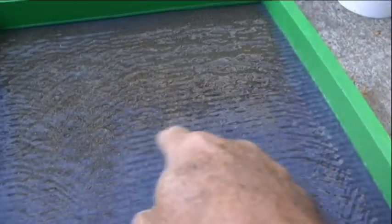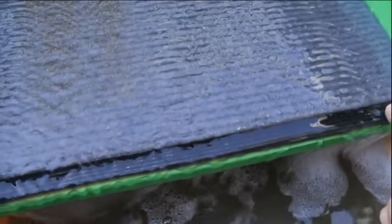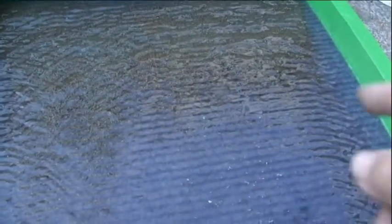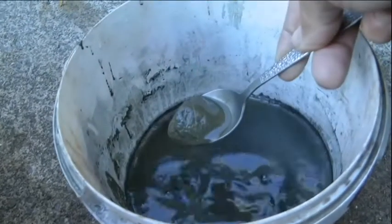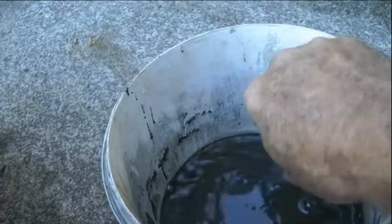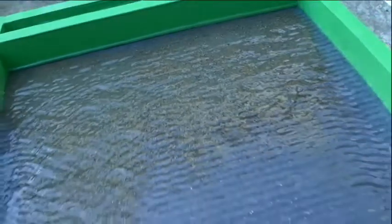I've got my little miller table set up here. Over the top of the V-ribbed matting I've put a ribbed carpet. I'm just running my sulphides — crushed sulphide ore — through there. I wet that up, otherwise it'll just float away. I'm putting it through here to concentrate my sulphides, and I'll do this before they're roasted.